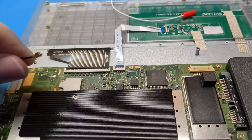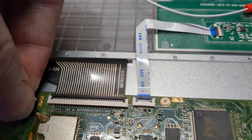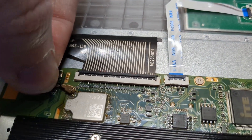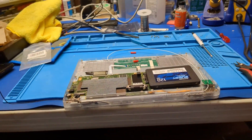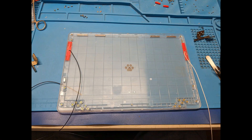Because these are normally UFL — that's what I always get. Well, guess what? These newer Wi-Fi 6 modules do not use UFL. They use something different. Unfortunately, I didn't get any more footage of this project, which I kind of wanted to. Anyway, I got the proper antennas finally. They did change the connector type when it came to Wi-Fi 6, and I didn't realize that at the time.